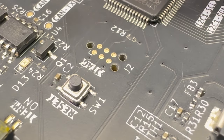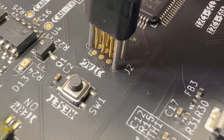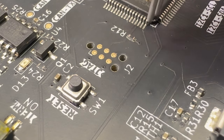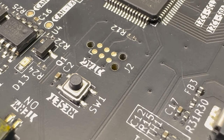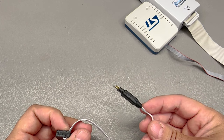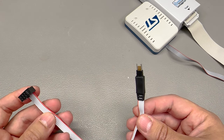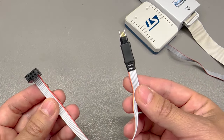This connection can either be handled manually by an operator — taking less time to connect and disconnect, with potentially more cycles supported per connector than a standard connector — or it can be handled by a test jig, because this is now just a very basic precise vertical movement, so it can be automated, making the whole production line faster, cheaper, and more reliable. You are potentially saving a minimum of $200,000 US on a 1 million unit project, plus some savings in labor costs.